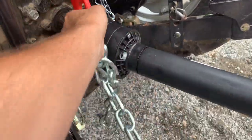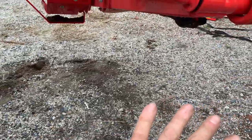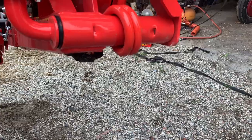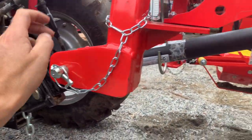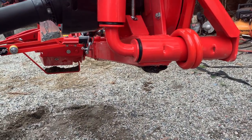You don't want them digging in the dirt, so it saves wear and tear. You kind of want it running on the soles here. Here's our safety chain. What you do is you lower this down to about 19 inches — so this section right here is 19 inches from the ground — set your chain here, and then every time you lower your three-point hitch the mower will go back to the same preset spot.